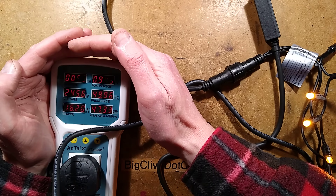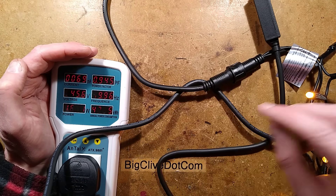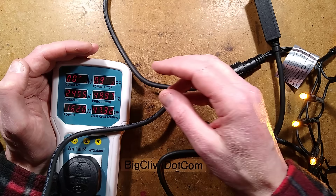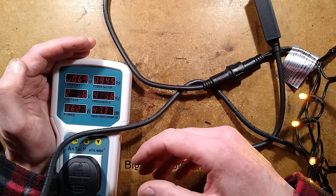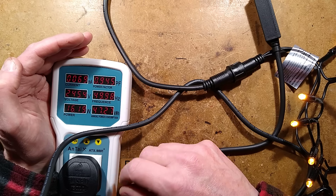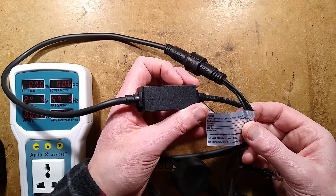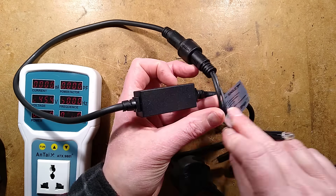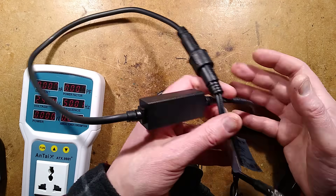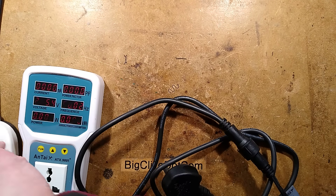The current of the string, which I know has four sections of LEDs, is 69 milliamps — say 70 milliamps — which is pushing towards 20 milliamps per section, meaning these LEDs are being driven quite hard. I wonder how long they're going to last. The power factor is amazing at 0.945 — that's because they're using resistors to limit the current. The power of the string is roughly 4 watts per section, so the total 250-LED string is 16 watts. That means you can plug a lot of these strings end-to-end, though I don't recommend that because if one set fails or a connector gets wet while someone's putting it together in the rain, it can cause problems and you lose a lot of lights. I recommend dividing it into smaller sections.